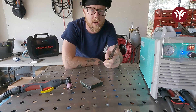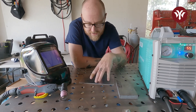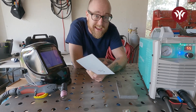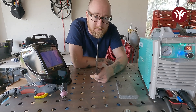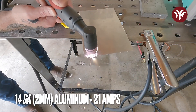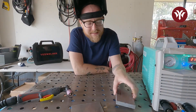So lastly, now that we've done carbon steel and stainless steel, we're going to do some aluminum. For the last test here, we have a block of aluminum 5/8 inch thick, and we have real thin aluminum sheet. For this, we've been running 55 amps on the thick steel and thick stainless, but we're going to come way down — we don't need that much power to go through something thin like this, especially since it's aluminum. We're going to turn the machine way down and continue cutting some butter. It went through that like it wasn't even trying.